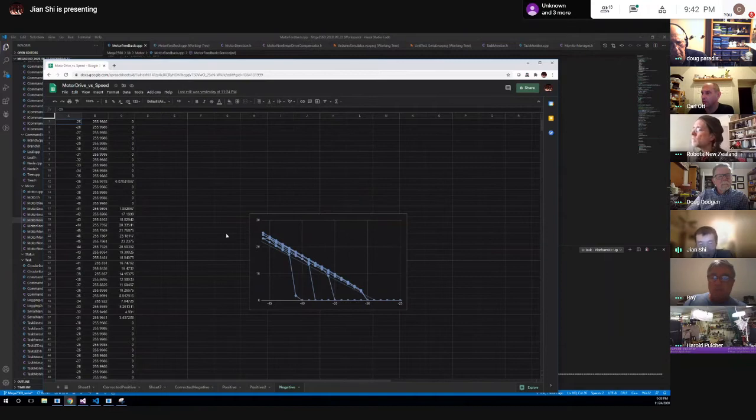I'm thinking the way I drive it is maybe I should give it a motion profile, where the feedback keeps going, but the feedback loop follows a time varying set point. Maybe I can put that set point as speed, or I can put it as a position. Usually when they say that, they're talking about ramp up and ramp down speeds. You shouldn't worry about whether it initially goes to 100 and then drops down. That's what should happen.